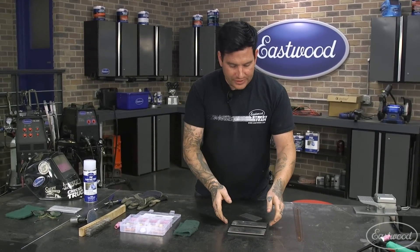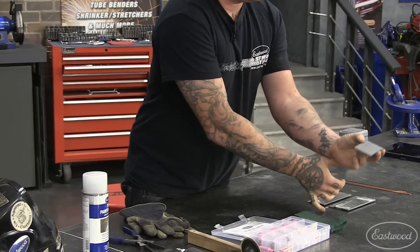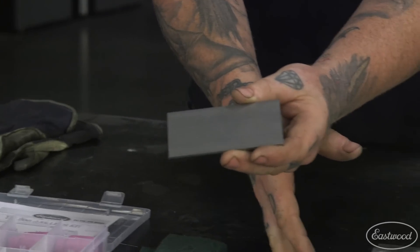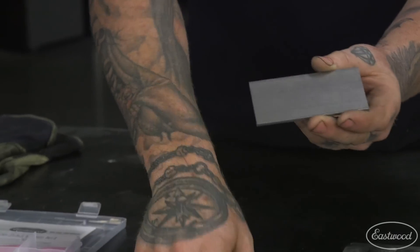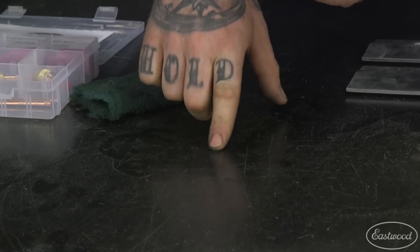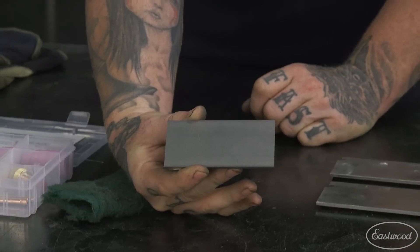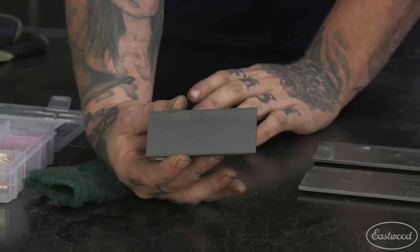What I have here is a couple pieces I got ready. This is just a standard piece of eighth inch steel — this is actually cold rolled. When you have hot rolled steel, there'll be a mill scale on it, which our welding table here has. You can see it has this dark gray tone — that's the mill scale. It's pickled and oiled; that's a coating that keeps it from corroding. This is cold rolled, so it doesn't have that coating, but it still has an oil and a film on it from the mill that keeps it from rusting.